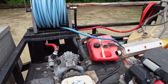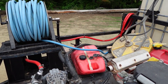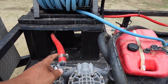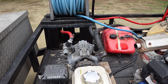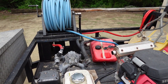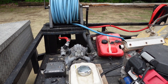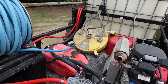Now, this is very important, guys. Extremely important, I would say. If you're setting up your roof pump, you want to put at least 15 feet on your bypass hose. This one right here, and you see how it's all coiled up, is 18 feet, and that's a 3/4-inch hose. I'm talking about this red hose, that's my bypass hose to my roof pump. For you guys that don't understand what that is, essentially think of a loop. When you're off the trigger, when you're not using your gun, you let go of the gun, the water creates a big loop inside your pump where water's constantly flowing through it. And that's why with the roof pump, you want to make it at least 16 feet or more.